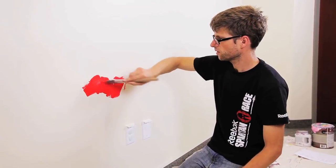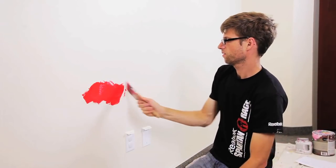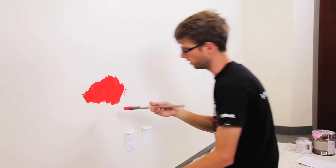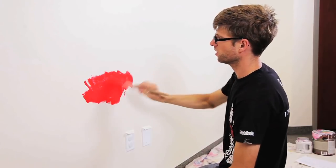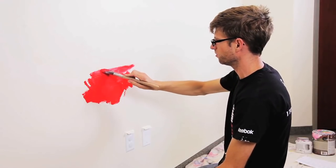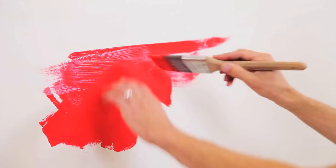See how when I go back and forth I'm bending the bristles instead of tilting the brush way far - I see a lot of that and it's not a good way to do it because it makes a mess. I'm just getting the paint in the bristles, dipping again just on the end of it. If you're new at holding a brush, don't expect to feel real comfortable with it right away - build up comfort by practicing. If I'm cutting a line, I hold it steady and drag it slowly. See that sharp line it makes? That's because this is a nice brush - a cheap flared-out brush won't give you that hard edge.